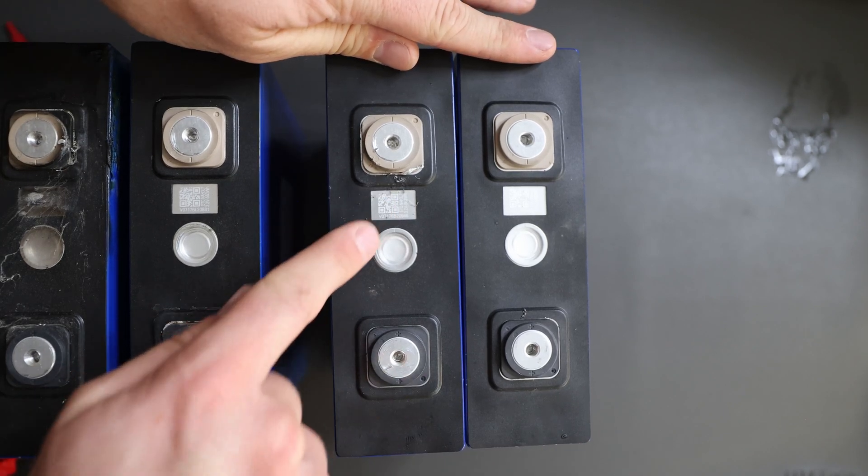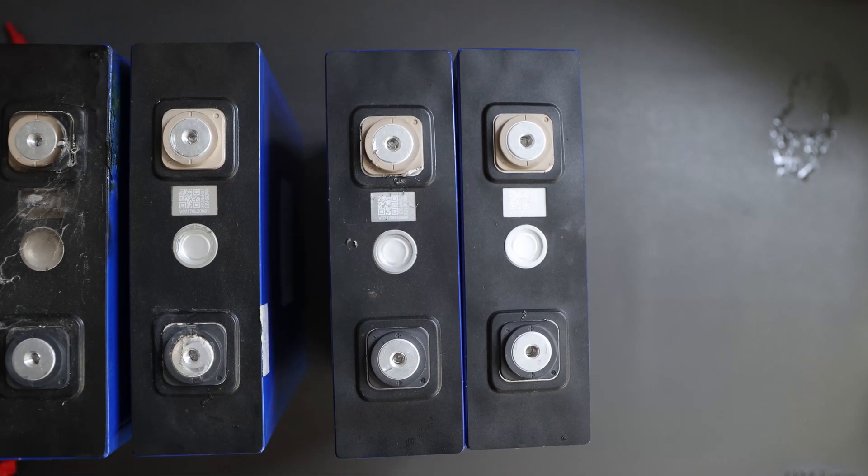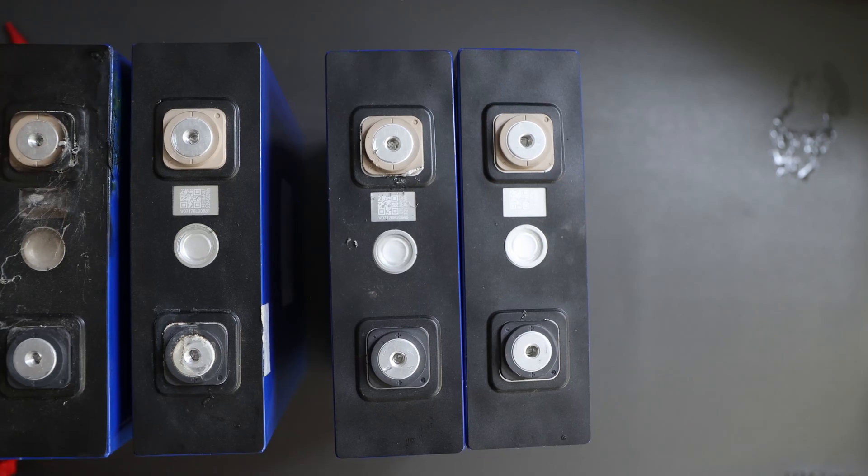Regardless — would I use this cell? I'm not tempted to, so no worries. That's a sad story. So, three out of four didn't work. Well, there's some voltage on two out of four, but I would not use the third one because it doesn't look too good on the terminal and it's already color changed. Maybe you have different feelings about it, maybe you like it like that — I don't. I don't like the risk on this part too much.